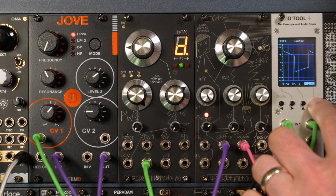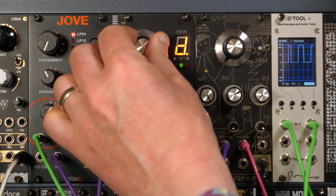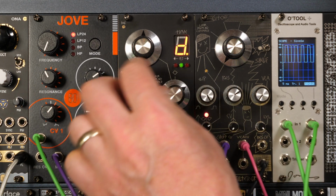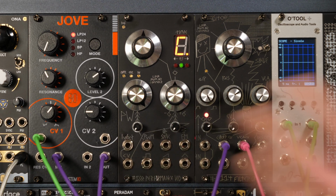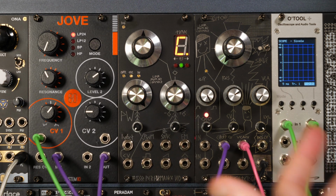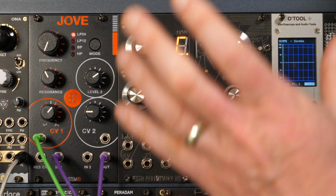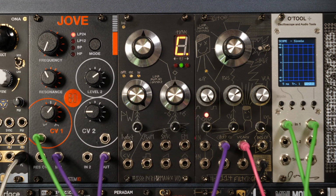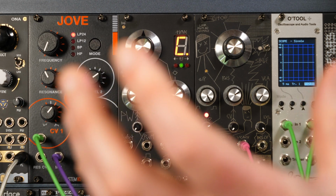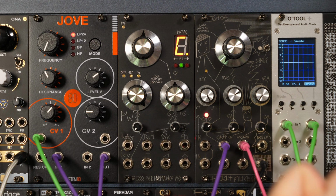If I go to, there we go, that's plus or minus 12, and you can see it's running purely at the top. And you may ask yourself, is that a problem? Well, it's actually not that uncommon to have unipolar output of oscillators. In fact, that's actually what comes out of the 3340 chip, which is inside here. The 3340 is the same oscillator chip that you find in the Prophet 5 and the SH101 and lots of classic synthesizers. So the 1222 is absolutely attempting to offer you a synth sound.